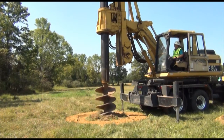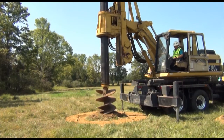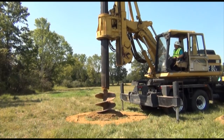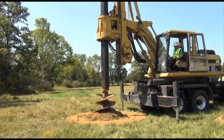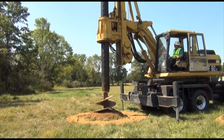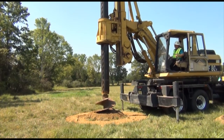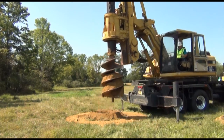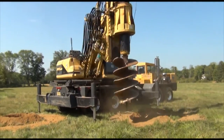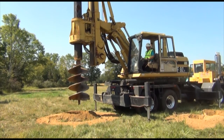In any location here, we do hit hard rock 3 to 4 feet, and it is 40,000 psi rock. When you crowd with the lower drive, it automatically feeds cable out on the inner bar so as not to knot the cable up at all. It works perfect. 1 lever to crowd and 1 lever to drill. Like I say, no letting the inner bar cable off while you're drilling. It's all automatic.